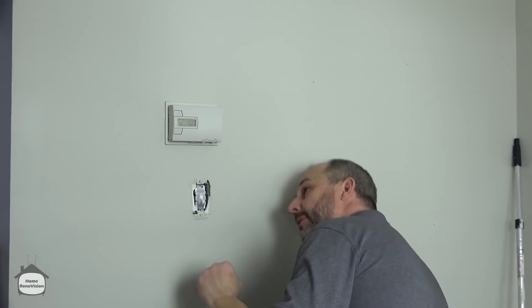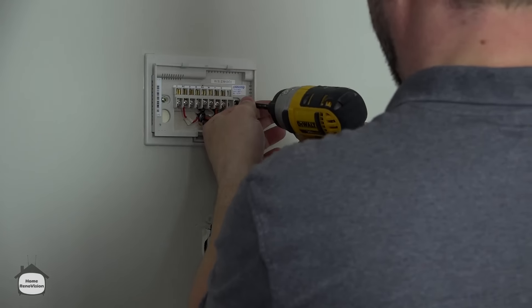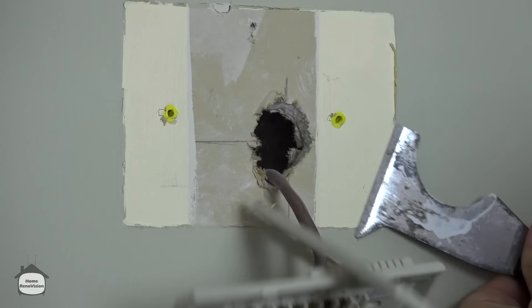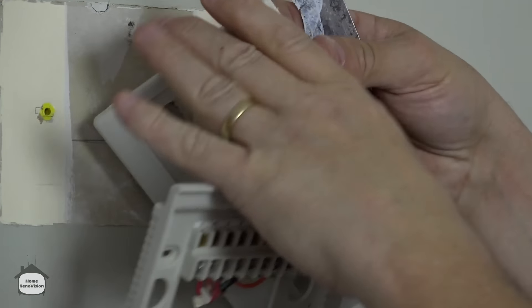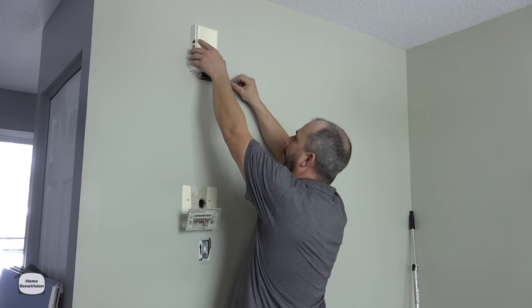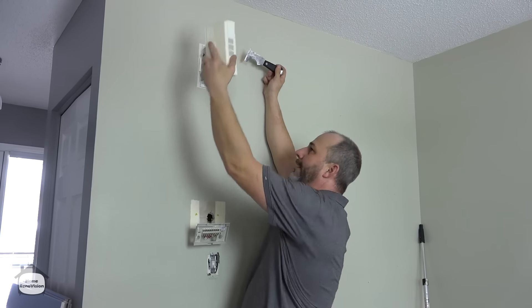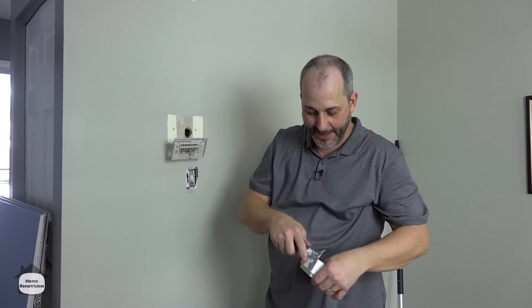The thermostats — again, remove them. They're usually installed pretty simply. A couple of set screws and the plugs in the wall. If you're going to change your color and you don't clean this up and leave it there, you've got to paint all over it just to hide the old paint color. Take the two seconds it takes. This is a doorbell cover — really nothing to it, except it's been painted in again, homeowner after homeowner. They just pop right off — just compression fit. Get them out of your way. Stop painting your plastic accessories.